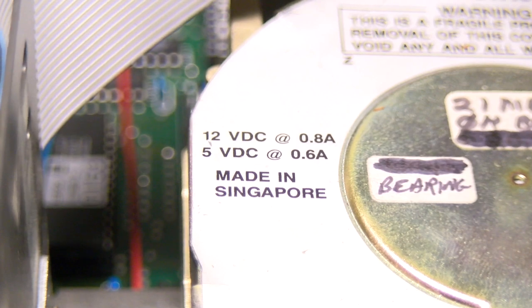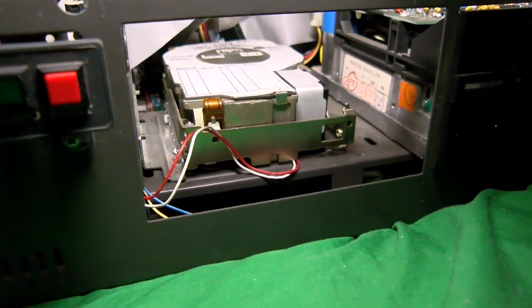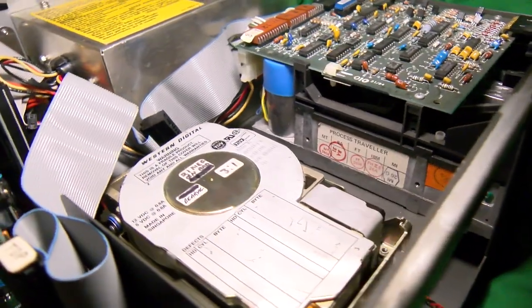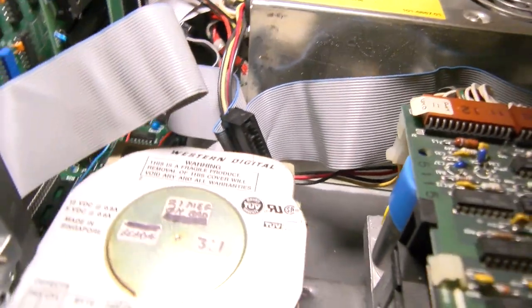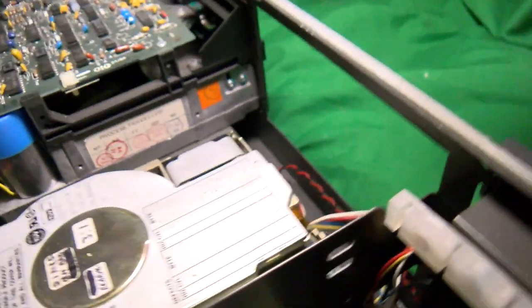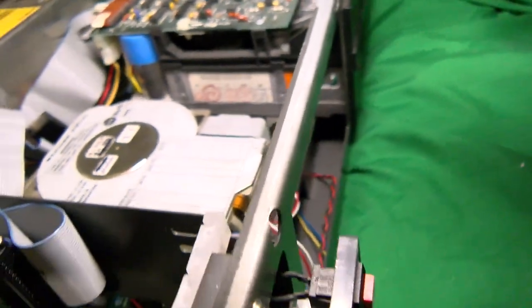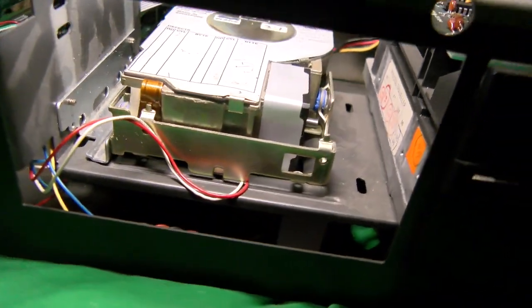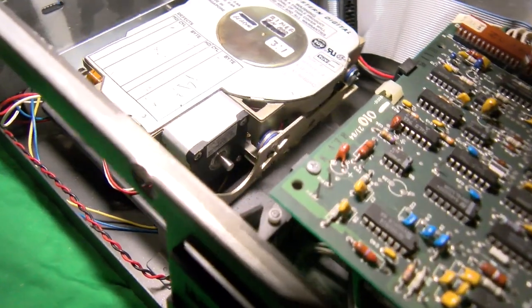The original IBM PC got around this by using an expansion chassis, which essentially just extended the ISA bus into a backplane in a second PC case, complete with its own power supply, and you could put the hard drive in there. Amusingly, the later IBM AT had the opposite problem with its bigger power supply, where you had to install a resistor dummy load in the hard drive bay.